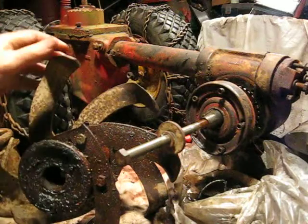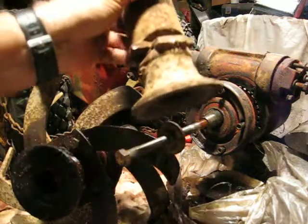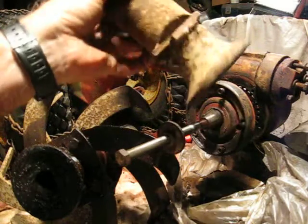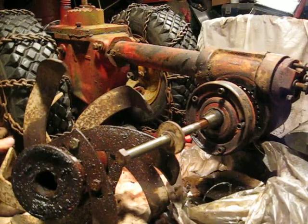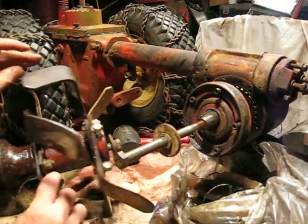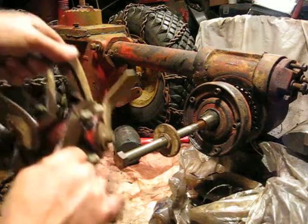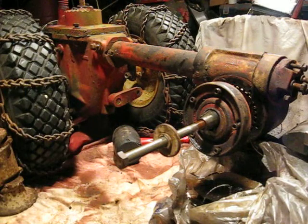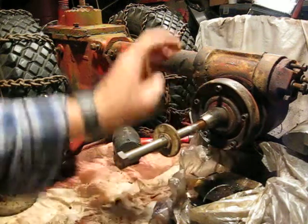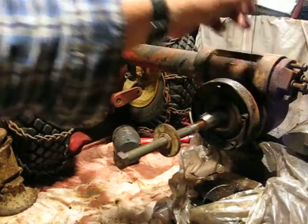It's pretty easy to take the rear tines off of these. The tines are attached to these here. Newer models are a little bit different, but these are cast iron pieces. It just has a single bolt that goes through the center, and for as rusty as everything was, it came off pretty well. You just undo it, take it out, and the whole piece here will slide off. Then what you'll see is something like this — there's only one piece that comes off on the left-hand side; the other side is actually built into the housing, so that does not come off.